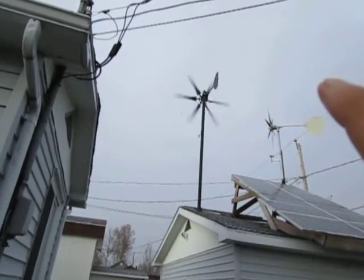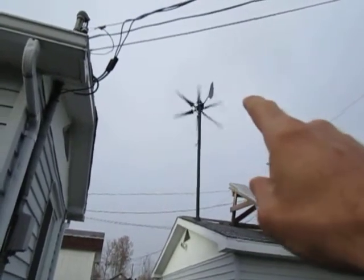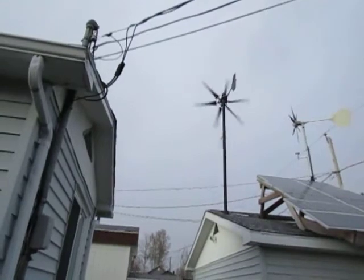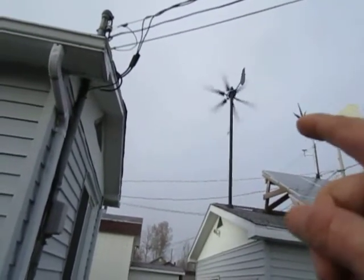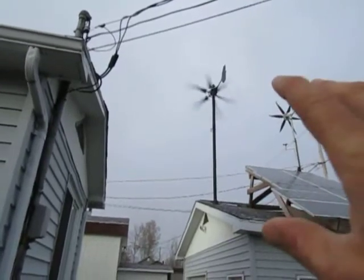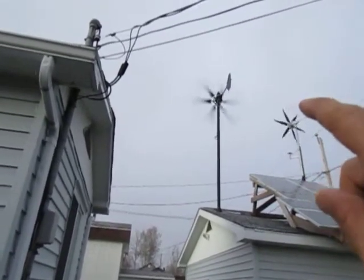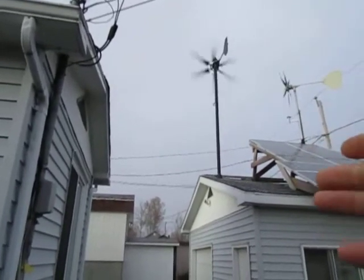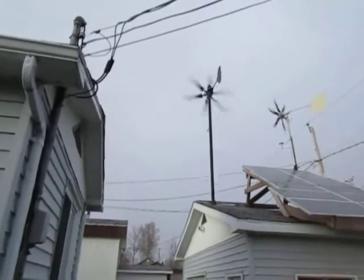So for the people that want to see early output, because it seems to be a big trend lately, go and ask Daryl to buy his hub and put the blades on it. That thing has monstrous torque, and I mean monstrous, because I did an experiment, and at around 70 RPM it started to produce in the batteries, but by starting to put power in so early, it kills the momentum of the blade. So to overcome that resistance that sits in the battery, you need to have a behemoth of a blade there, and that thing just does it.